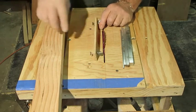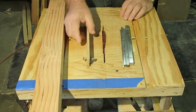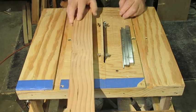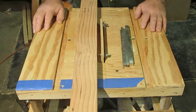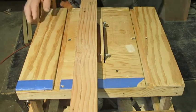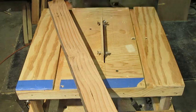This happens to be a piece of the scrap tabletop with a couple of T-nuts inserted and then some bolts with some locking wing nuts put into it. All I have to do is set up the depth from the back of the wood to the head of the screw, bring it up to the saw face, and bring up my fence. This works great for the small stuff, but not so much for the big stuff. So what we want to do right now is set up for the big stuff. And the first thing I'm going to need is a runner for the miter slot. I just happen to have this already preset for two centimeters from the back edge to the front edge.